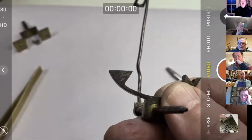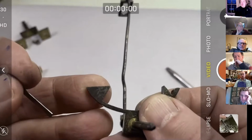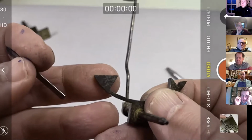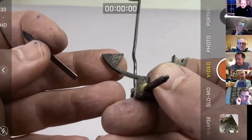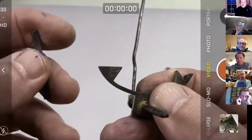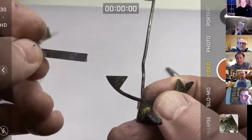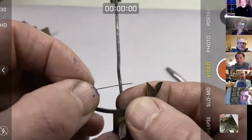The other material, for those people who've just joined us, is that we looked at using gauge plates, so ground flat stock, which is a modern ground tool steel, which is also good because it's new and it's plentiful and it hardens really well. So last week we cut our bit of steel. Once we'd annealed it, we cut it down to about 0.2 of a millimeter too wide.